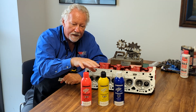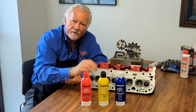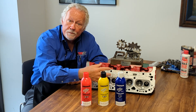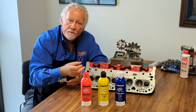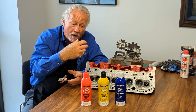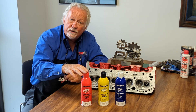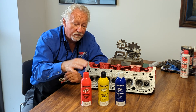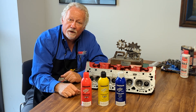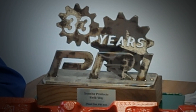Then you use our developer. You spray it on — it sprays on like a liquid talc powder — and as it dries, it'll be white in texture. Wherever there is a break or a parting line within that casting, it'll draw out that red dye that you initially sprayed on the casting first. So it's very visual and very quick. We're here for you, here to keep America's wheels rolling — thank you very much. Let's get started.